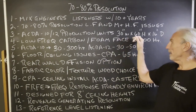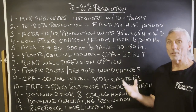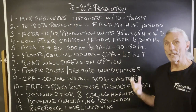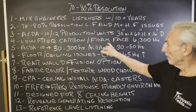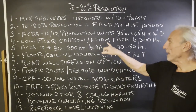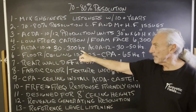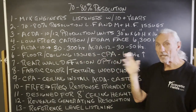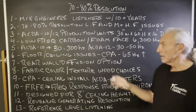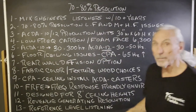We have 30 inches wide, 60 inches high, 16 inches deep. These are big units that create a big presence in the room, so you've got to have the right spacing and distances for them to work. We have low-frequency carbon on the inside for low-frequency management, and foam face goes all the way up to 6,300 Hz. The ACDA-10 covers 30 to 300 Hz; the 12 covers 30 to 50 Hz. Those are the two problematic frequency ranges in all small rooms.